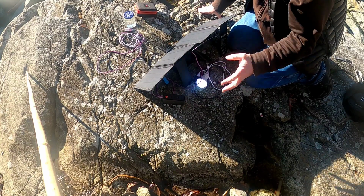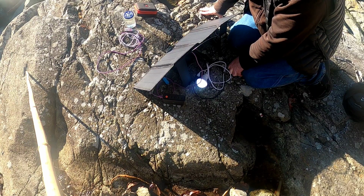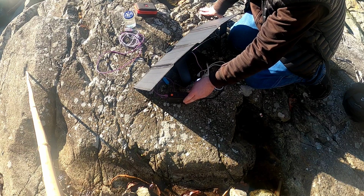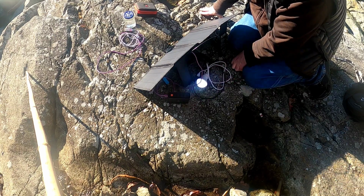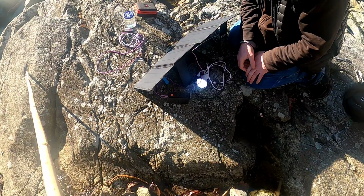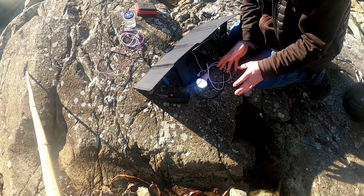But as an aside to that, in one of the near-term future videos I plan on doing a Lifeboat Generator, where I plan on using 100 ampere hours. This is only 20 ampere hours. I'm going to do a battery that's a little bigger than this, with 5 times the capacity. These are lithium ion batteries, and I'd be using lithium iron phosphate batteries, so the cycle life steps up to about 4,000 cycles before those batteries are drawn down to 80% capacity at maximum charge. You could use that type of setup, well, for me until I'm dead, really, before those batteries are going to run out. And I could do the same kind of thing if I was doing an underground shelter and wanted it to be covert.